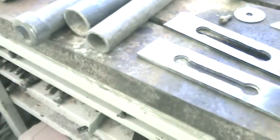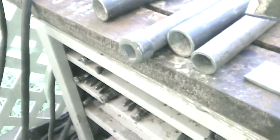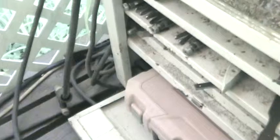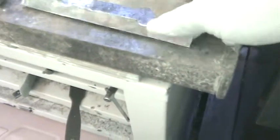You can see I slotted these. I learned my lesson from this one — don't bite off more than you can chew because it'll take forever to get the thing done. What I did with this one was I just went down a line in between each of the outer holes with my step drill and drilled holes until they started to open up into each other and pre-make the slot.